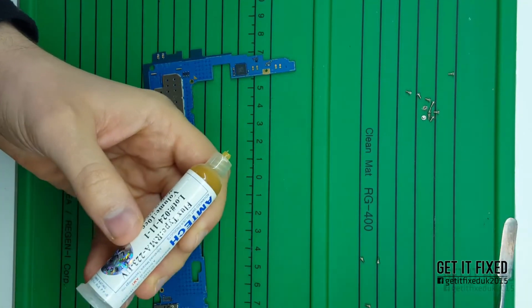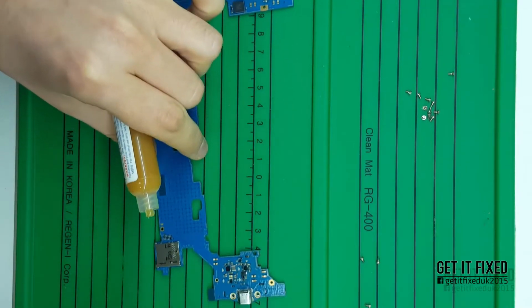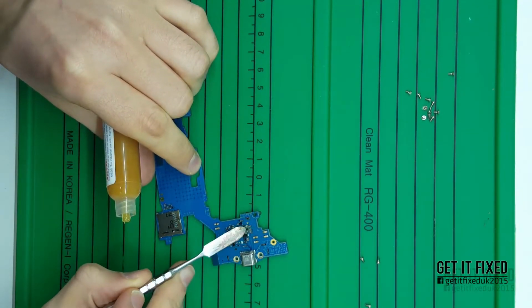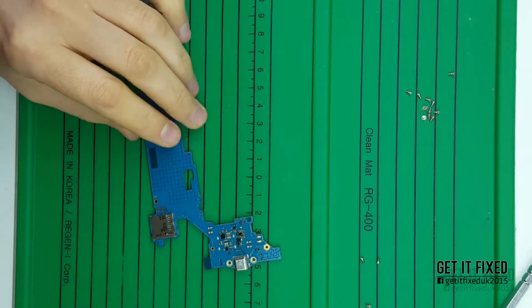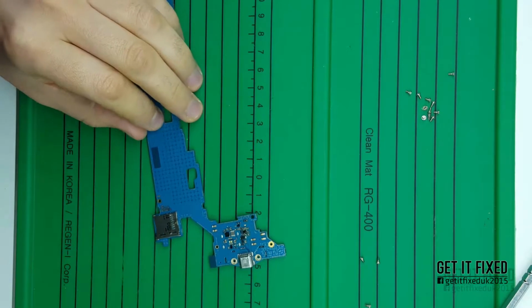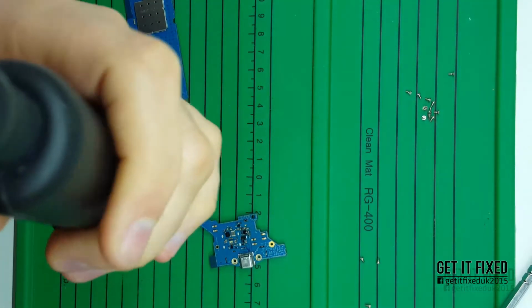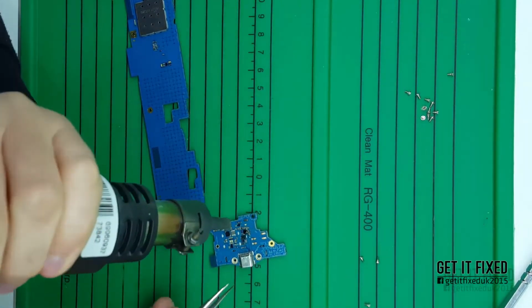But when they expose the main PCB in the oven, so it melts everything and aligns it properly on the board, I think it's not exposed enough. So in time, these kinds of small chips get disconnected. This could be the reason why you sometimes need to reflow it.